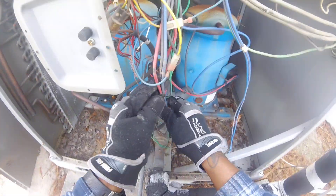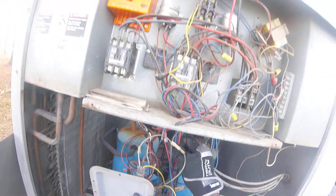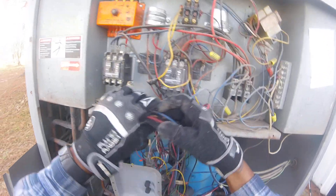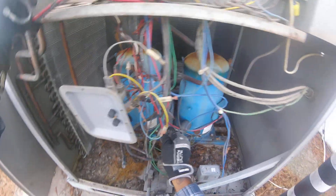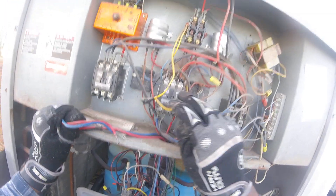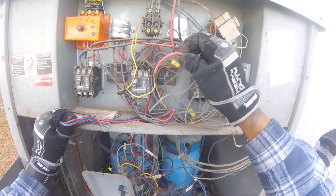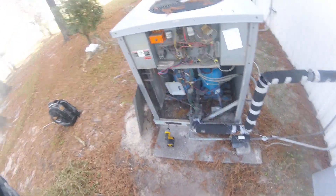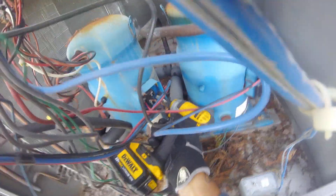The cap is off on this so I can see inside — it's getting wet in there. I see now — this compressor is disconnected. These leads go to this compressor, and these leads go to this compressor. This is the one with the broken switch. My battery is running low on my recorder, so let me hurry up and check this compressor — check the ground and check the insulation.